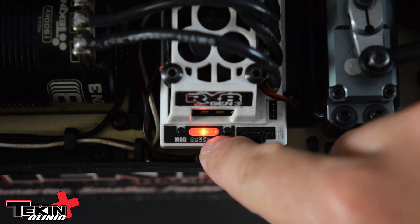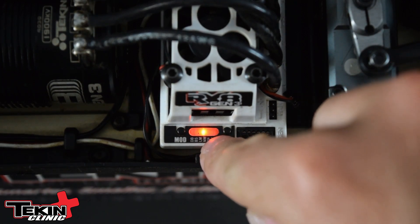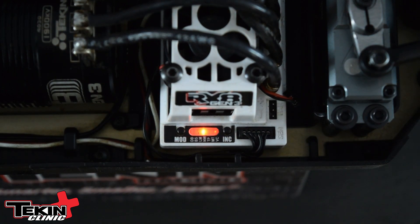Now pay attention over here to the right side of the LED bar — LEDs 5, 6, and 7. These are dimly lit and will activate as each sensor is hit in the motor. You can see that some of them are dimly lit right now, and if we rotate the motor shaft slowly by hand, you can see them cycle through. This is a good way to verify that all three sensors are working as intended.